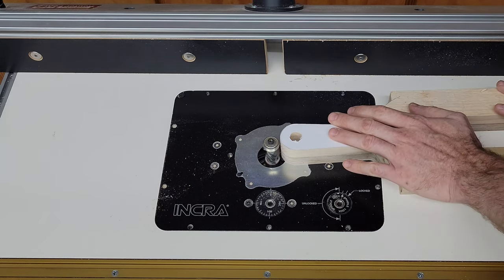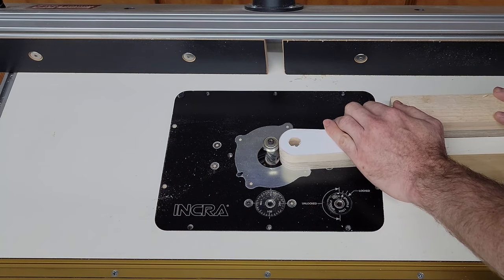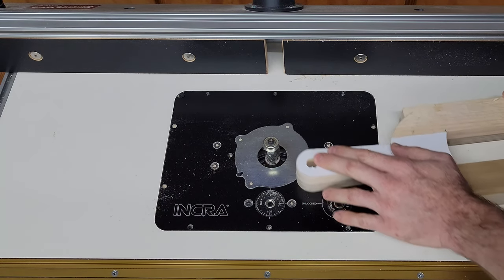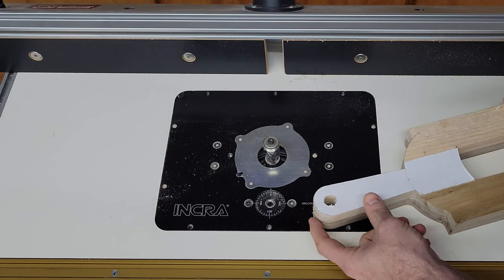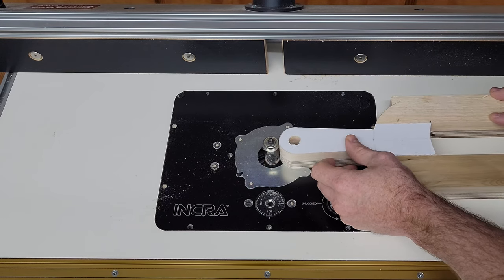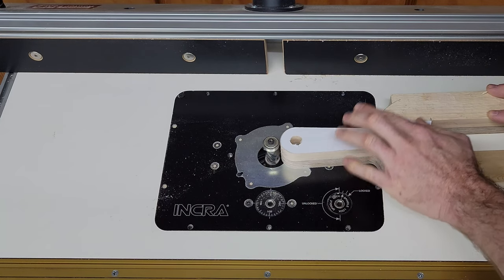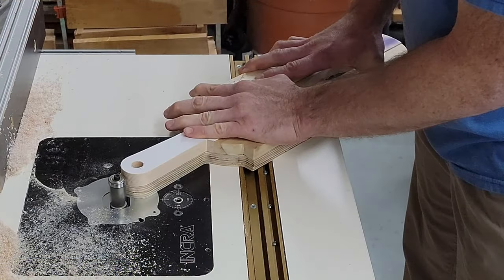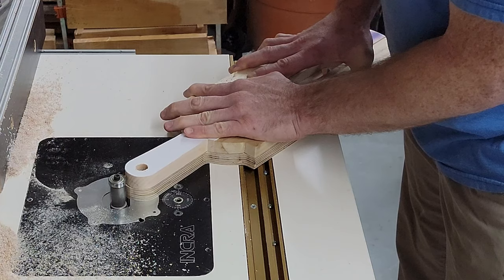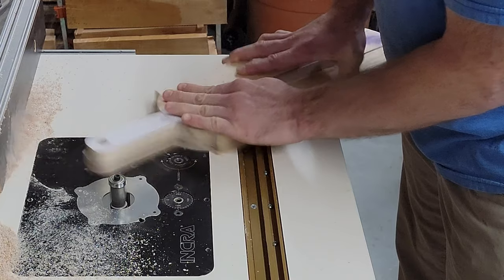I don't know if you caught it, but what actually happened was, as I was coming around this corner, I wanted to move my fingers out of the way, because that's not a good place for fingers to be. There was a little bit of extra wood right here that hadn't been cut on the other side of the handle, so the template was not engaged with the bearing. I pulled it back a little bit and stopped actively pushing into the bit so I could reposition my hand. When I did that, I think I turned the board just enough that it engaged the bit again on that extra wood sticking out